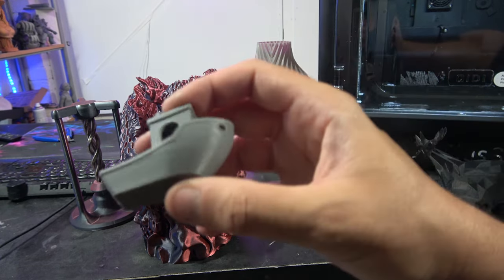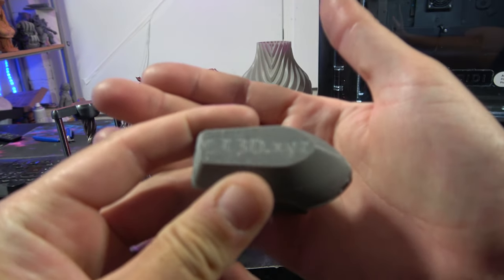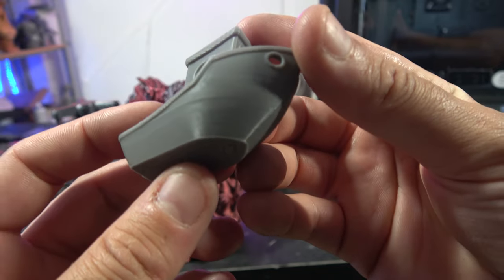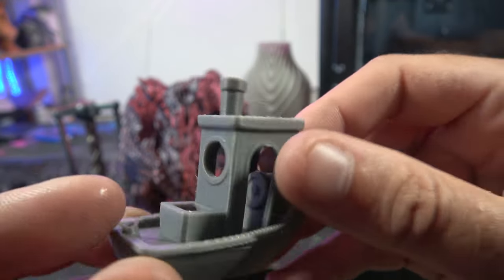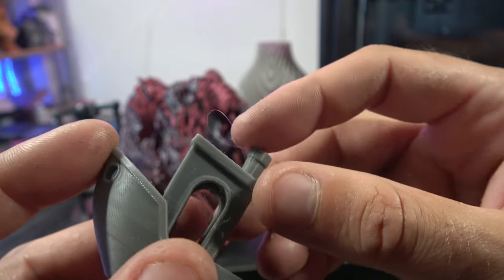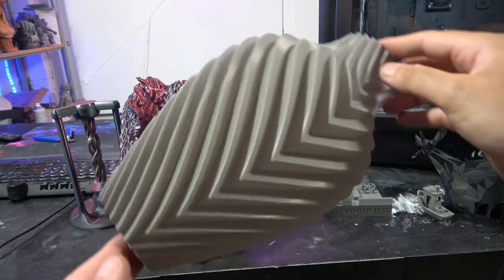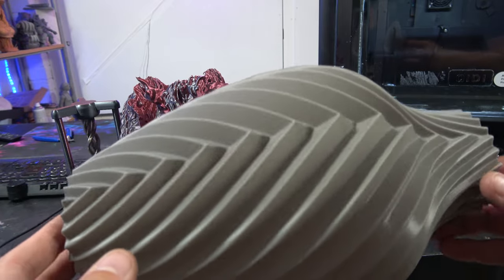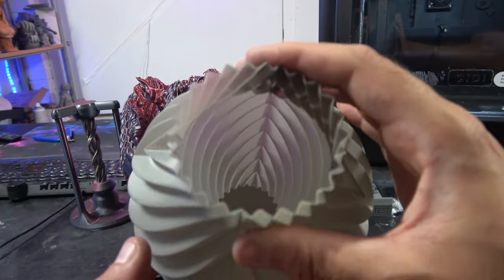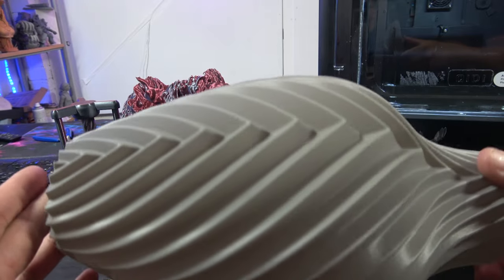We've also got the obligatory benchy. The first layer went down really nicely, you've still got that texture on there. Pretty good on the walls — it just did a little mess up just there — but good on the bridging, no retraction issues, no wispiness, nice smooth smokestack. Really good. Then the vase — got that textured surface and there is not a single under-extruded line on this print. It is lovely — a really, really good job for a single vase printing at 400mm per second. This is a stunning print.